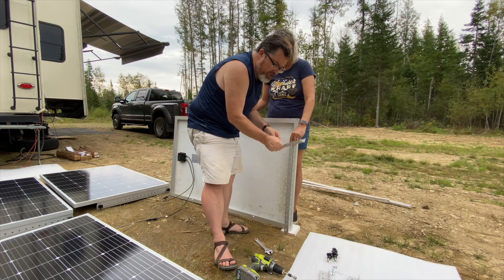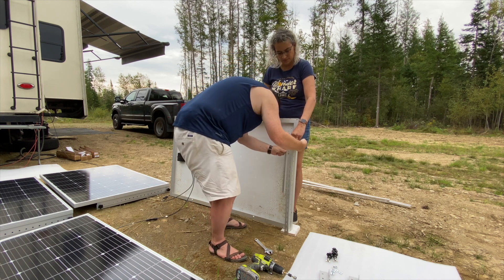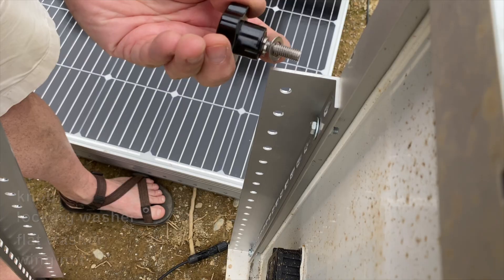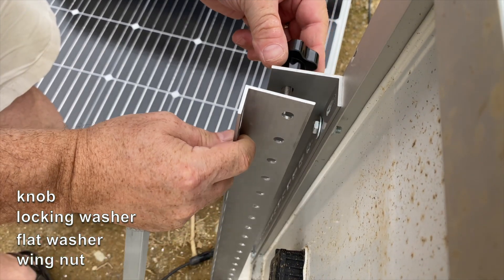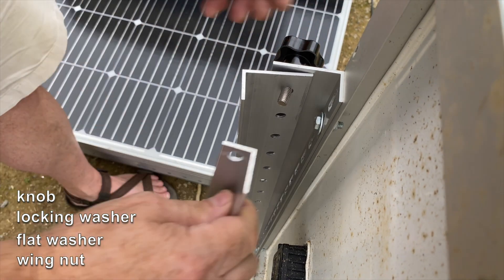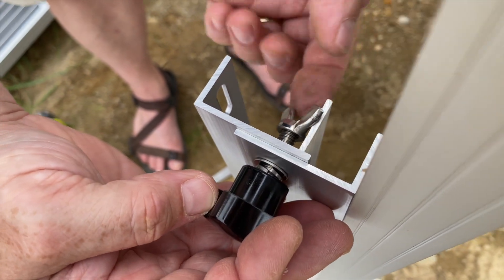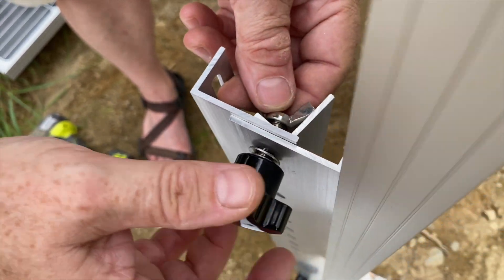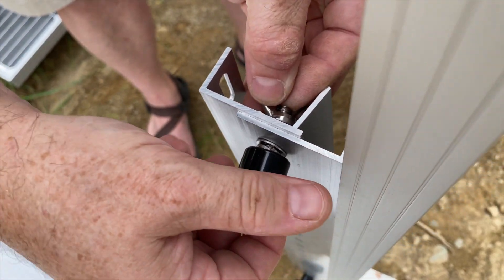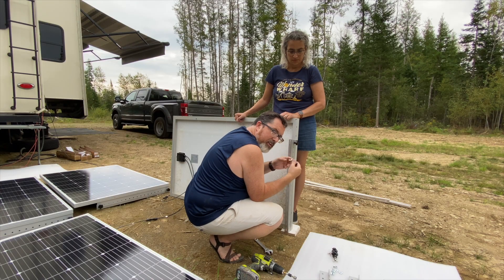This little armature creates the third leg of the triangle for tilting. On these big knobs, we also have a locking washer, a flat washer, and then a wing nut on the inside. The locking washer keeps tension against the nut and bolt threads so it won't back off — hopefully not at all. It does the same concept as the nylon nuts: it locks so it doesn't back off, because you don't want these coming off when you're going down the road.